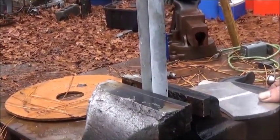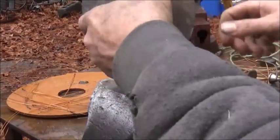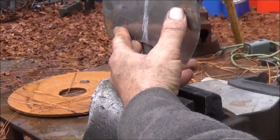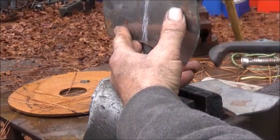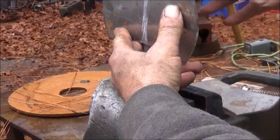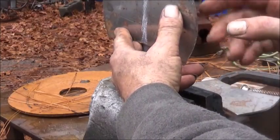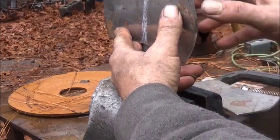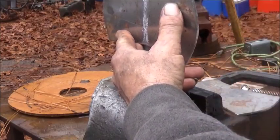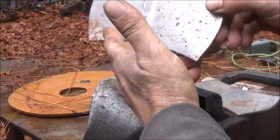So we're going to put one plate on each side, like this. We're going to take two C-clamps, put on there, and we're actually going to heat it and try to bend them in together, and then we'll keep working with it, and we'll put our two eighth inch pieces between, so we can try to get it exactly right. So anyway, let me get it set up here. It's going to take about 8 arms to do it.